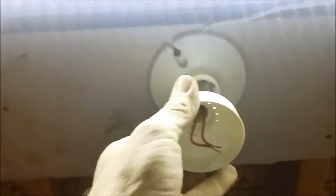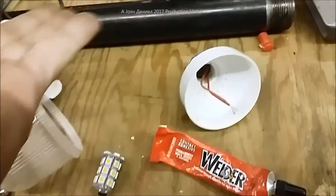In my shop I have a 12-volt outlet using an E27, and this is my nightlight in here so I don't have to run these big huge strip lights. The strip lights pull about 16 watts total, and the ones over there for lighting my back walls pull 21 watts altogether because they're smaller bulbs doubled up - they make it real bright. We're going to do this up to make a little night light that runs on about a third of an amp.